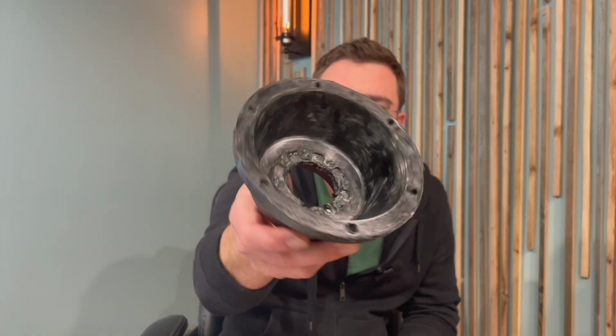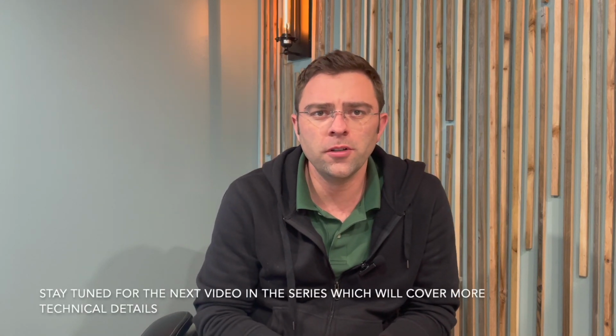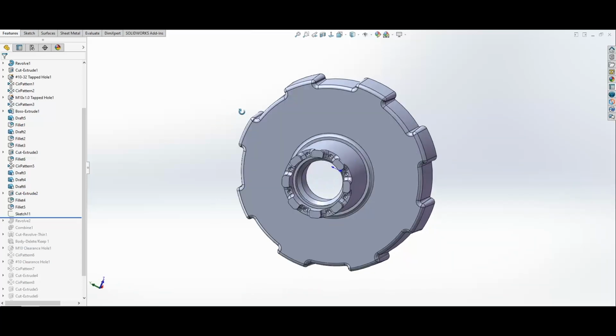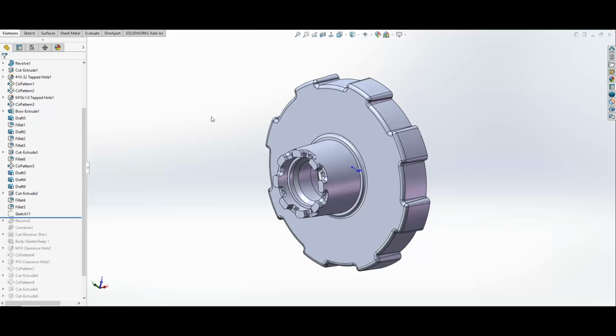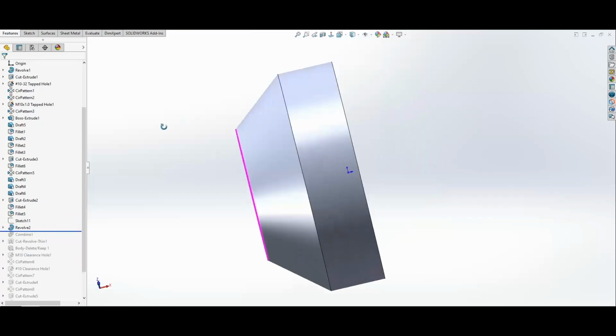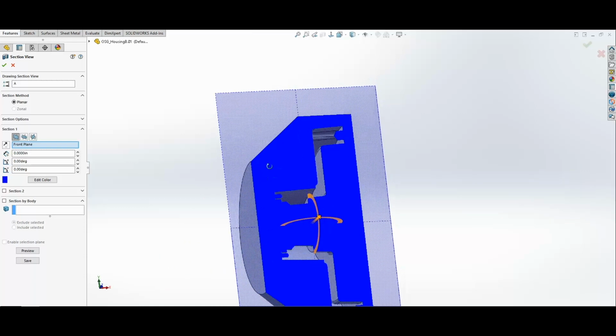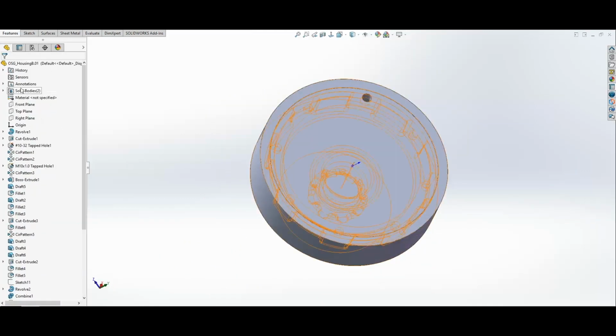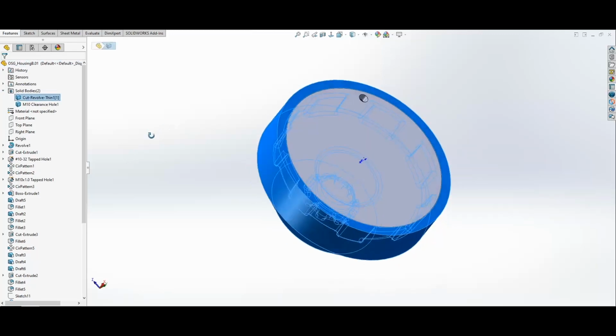You can see the carbon playing on the inside there. I'll walk you through a little bit of what's involved in designing a mold to do this process over here. So to make a mold, we need a body that can be the mold and just has everything that isn't the part in it. So we build out a revolve that covers the whole body. So you can see that the part exists in the center of this now. At this point, we've separated it into two separate bodies. One that is the outside of the mold, the other that's the inside of the mold.